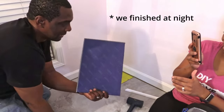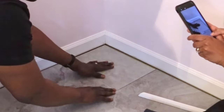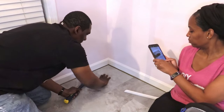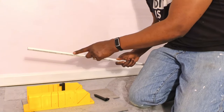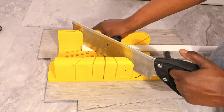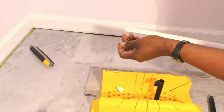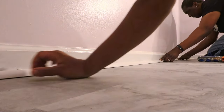This is the last tile — that's it, we're done! Now we're at a point where we're going to put down the trim for the room. We're going to add some waterproof quarter round trim molding and use all-purpose glue to make sure it's nice and tight against the wall. We're cutting at a 45-degree angle, which helps the trim fit inside the corners of the baseboard. We glued the quarter round against the baseboards and not the tile, since the tile needs room to expand.